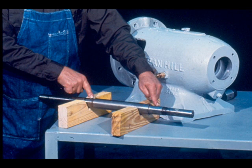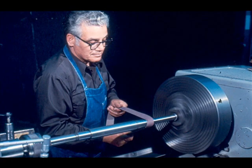Although the actual removal of the old bearings is now complete, it is necessary to prepare the bearing fits for the replacement bearings. First, mount the shaft between centers in a lathe and polish it carefully for inspection purposes. Be very careful not to remove any metal during the polishing, as we do not want to change any tolerances.